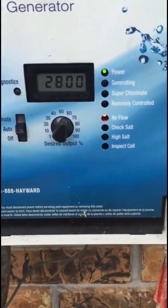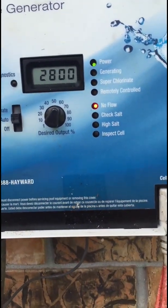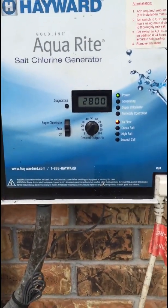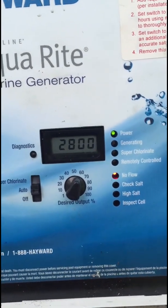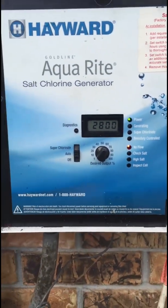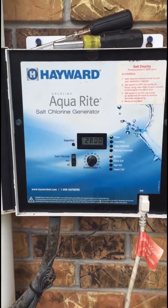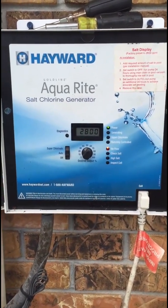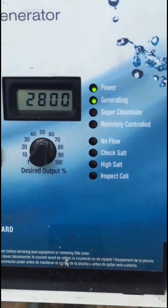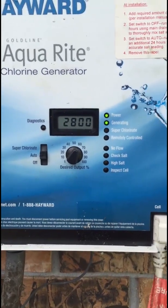I got the panel on and turned it on. This is going through a normal cycle — I've got my LED power light on now. In a few seconds that flow light will turn off. My flow sensor is working. The salt reading looks a little better than it did — last time it was saying 3500 even though the pool is about 2600, so that's within a margin of error, which is good. About a minute went by: power is on, none of the other warning lights are on, which is good, and it's showing about 60% output. Salt reading looks about right — this thing is fixed.